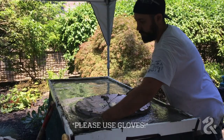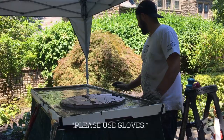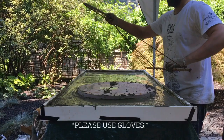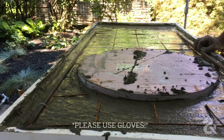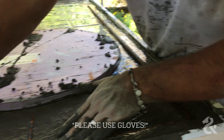We've poured about two-thirds of the way — closer to half, but roughly two-thirds. Now we're going to lay in the rebar assembly. You want to make sure you have at least half the concrete poured before placing the rebar so it sits in the middle of the countertop — you don't want it sinking all the way to the top surface. Set it in place, not too close to the edges, and push it in slightly.